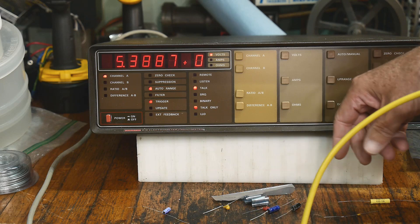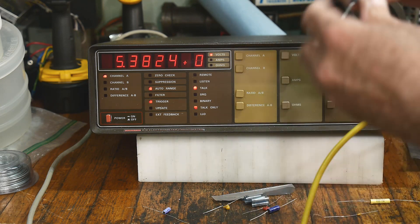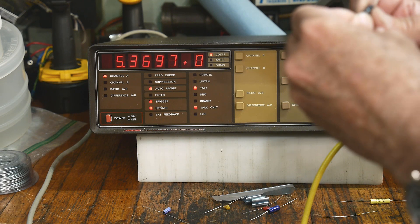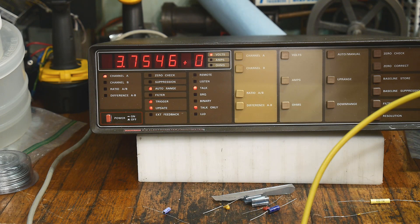Here is another kind of off-brand capacitor. This one is 22 microfarads. Let's put that in here. 22 microfarads — let's charge it up. Just have to touch the leads on it and boom, we're charged. You can see this one leaks too. Let me put the lid on the box to be consistent with everything. It doesn't really seem to matter much in this particular measurement.